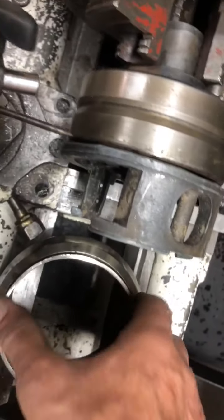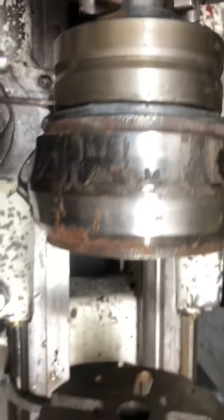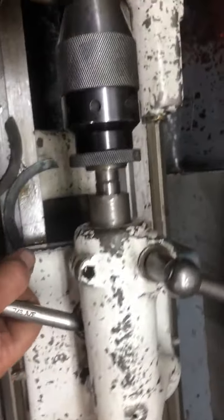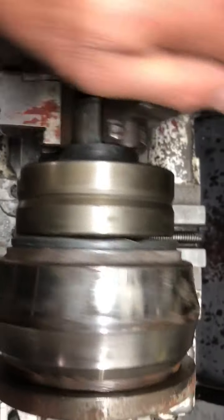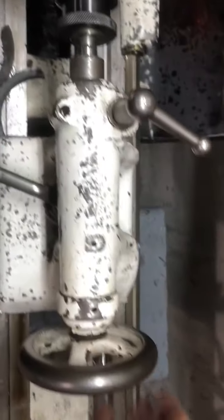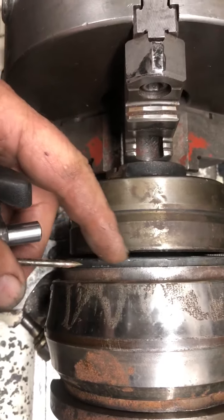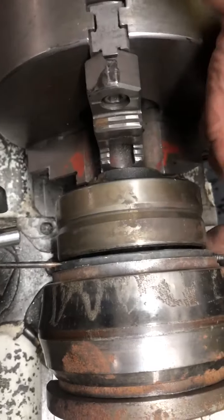So the concept here is to take another giant old bearing race that I've cut and put a sleeve into to fit the outside of this exactly, and then use this pusher plate, which is 90 degrees, lock it into the tailstock, heat this die cast to 450 degrees, which is the magic number for die cast, and then squeezing it with the tailstock, we will force this lip down to be flush with this perfectly round edge.